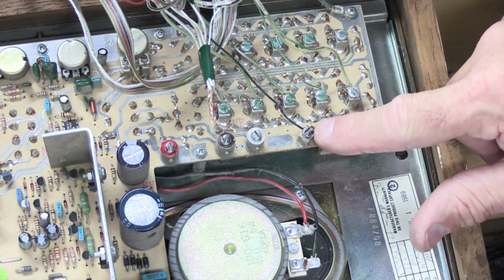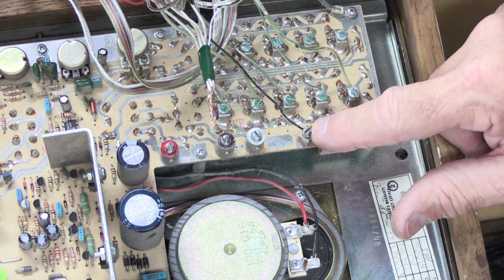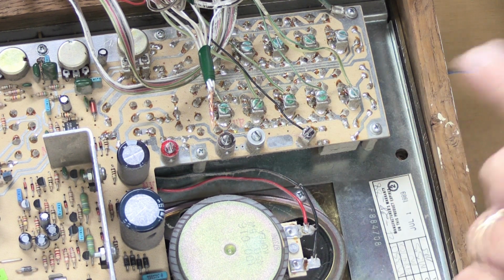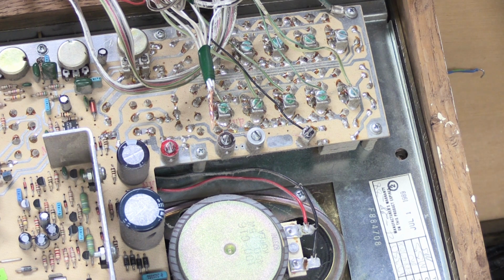The next thing we're going to do is disconnect the one black wire for your door station. Now, if your house has 2 door stations, there will be 2 wires under this screw, both black. If you have 3, guess what? There'll be 3 black wires. Doesn't matter how many wires there are, it's just a matter that you keep it organized.